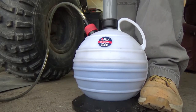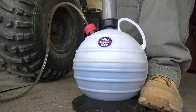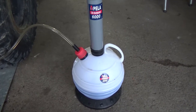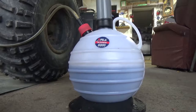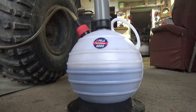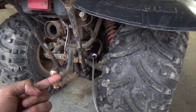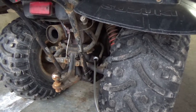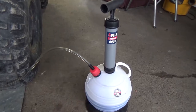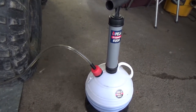I think that's pretty much all of it — we're just sucking air now. It's got quite a bit of the oil out, pretty much just where I thought it would be. But we have to remember that that little tube inside could be coiled up around at a high spot, so I'm going to pull it out now and just fish it around a little bit with the Pella extractor still pressurized to try to get a little bit more oil out of there.